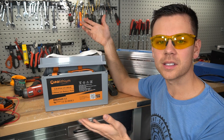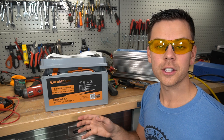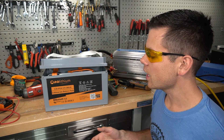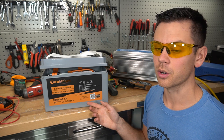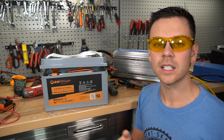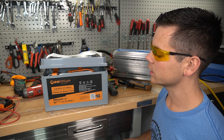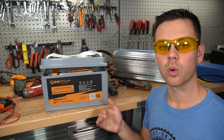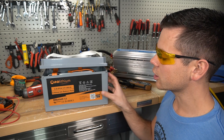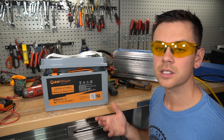For the price — think about $630 — this battery is also UL listed. I do not mean certified by a third party or conforming to a UL standard; it is actually listed by Underwriters Laboratory. Previously, to have this type of listing on a lithium iron phosphate battery, you'd have to spend at least $1,000, usually around $1,300. So pretty impressive. It is $60 more than an SOK, but considering the current it can push, if you need that for your application, this is a fantastic battery.